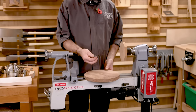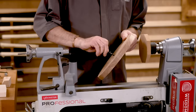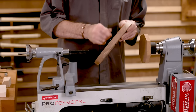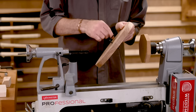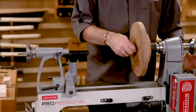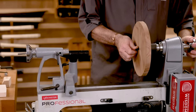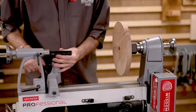Then we want a similar style bolt. So this is a threaded bolt with a washer head. This is going to be used later as well. So we can screw this through. Oh, nice and firm, that's good. So we're not going to get any wobble. Do this up. Important, if you drill your holes, your 6 mil, that it's the same diameter as the bolt you use. We can do that up. That should do. That's quick and easy, fixed on there with that central hole.